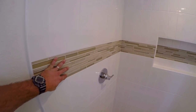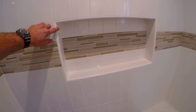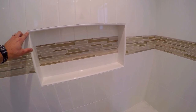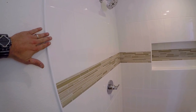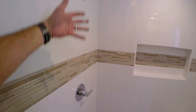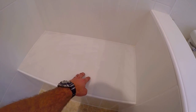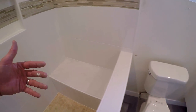We've got a nice glass and porcelain inlay or stripe. We trim the shower out with a quarter round Schluter white PVC — nice tight miters. Everything looks great. It gives it a nice low profile look using this quarter inch PVC Schluter trim. Nice Delta valve chrome matches the grill. We incorporated some other material. We've got a marble solid surface for the bench, which gives a nice clean look. The marble matched well with the porcelain floor as well as the wall tile.